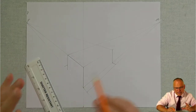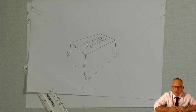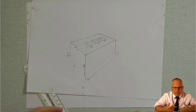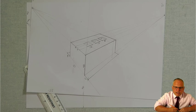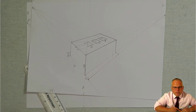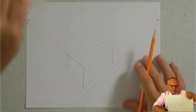So my next question, I need a centre line, and what you'll notice is that I've drawn 3 square holes to suggest where the pencil or the screwdriver or whatever goes. Making a square hole is more complicated in a normal workshop than making a round hole, because obviously we're not drilling it. But in industry, in a manufacturing environment, you would be able to punch out a nice square hole quite easily as part of the manufacturing process, maybe at the same time as you're doing your folds and bends. So that would be stamping out or punching out. So I'm going to stick with squares.